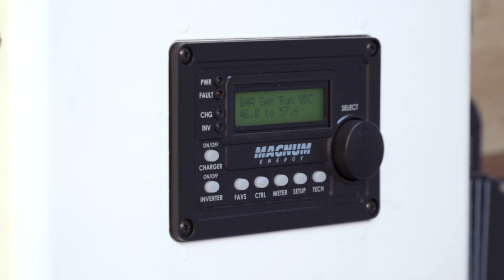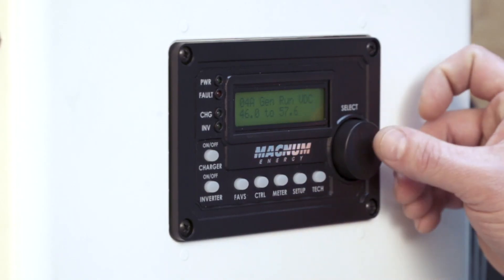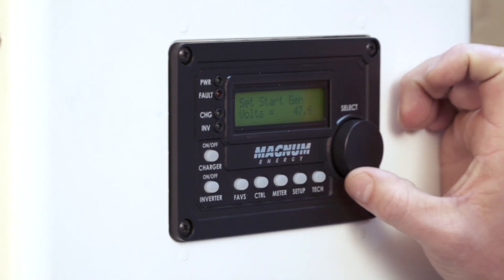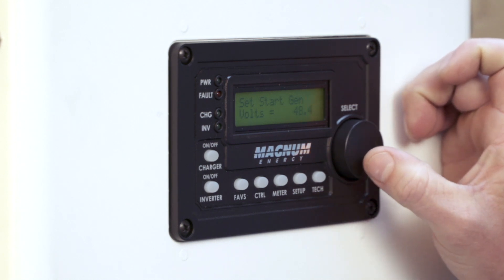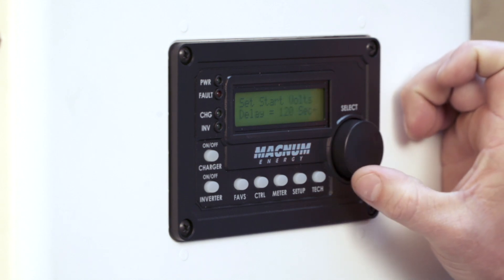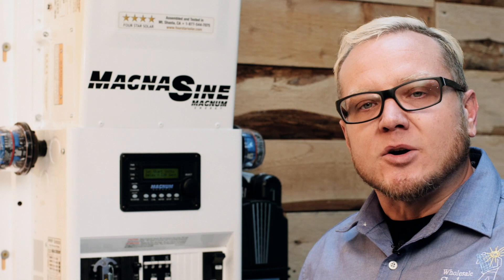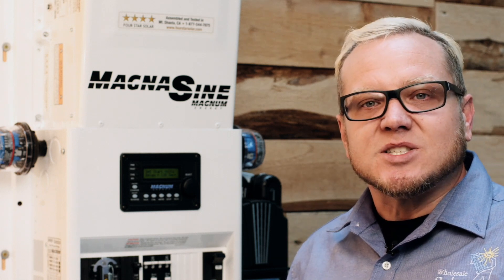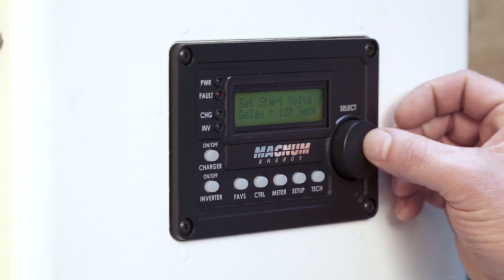The default on here is a little bit too low for me. In general, we want to be looking at keeping our battery bank above 50% if we can. To be in that range, we're going to have the generator start at about 48.2 volts. This remote will allow us to go 48.0 or 48.4 — we'll shoot for 48.0. It's got a delay; the default is 120 seconds. This is so you don't have nuisance starts every time a larger load comes on. Things like well pumps can temporarily pull your DC voltage down, and we don't want the generator kicking on every time. So the battery bank voltage will have to be at or below 48.0 for 120 seconds to start the generator.